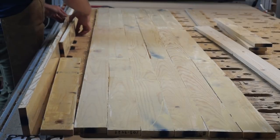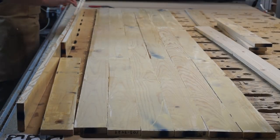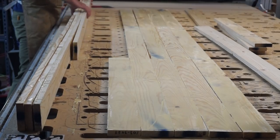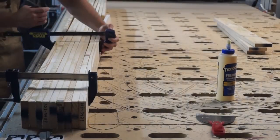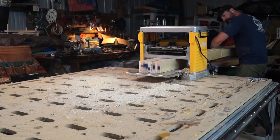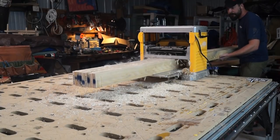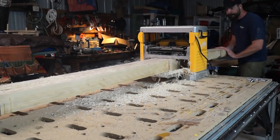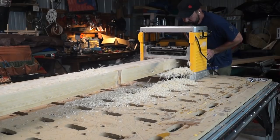After I got glue on all of them I laid them up on end so I could clamp them together. You can see there's a little bit of warp to the boards and I was hoping that once I clamped it all it would be moderately straight — and it turned out all right. I needed one flat side, and at this point I didn't know if I was going to hand sculpt it or use the CNC router, so I used the planer. This is a bit much to push through the planer but it did okay. Be sure to support the far end or else it'll fall and screw up your planing surface.